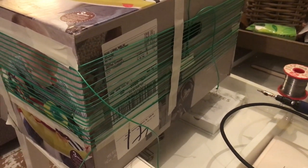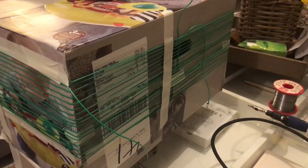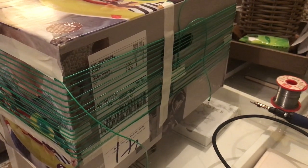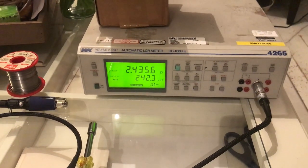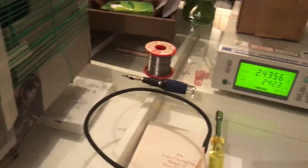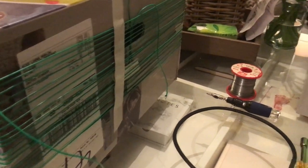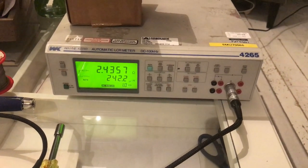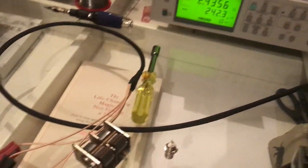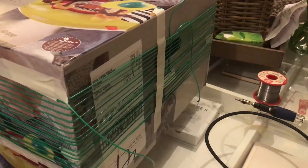Here's another one I've built tonight — it's about 42 centimeters square, so about half the size of my original induction loop. With a bit of educated guesswork and the online calculator, I wound 18 turns onto it, then connected it to the LCR meter. I was pretty close; it was a bit low on inductance, so I pulled the turns together a bit tighter. Rather than having to add wire, I was able to increase the inductance to the target of about 240 microhenries — right now it reads 242 microhenries.